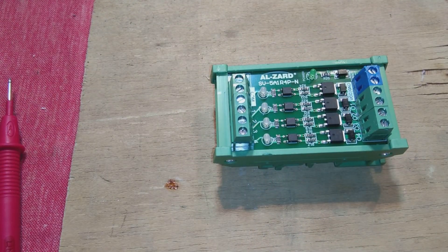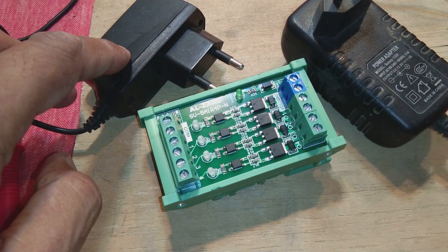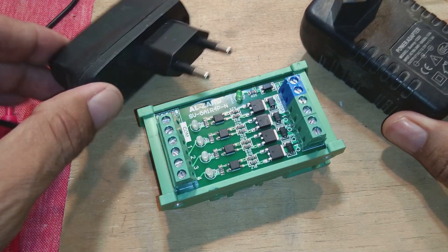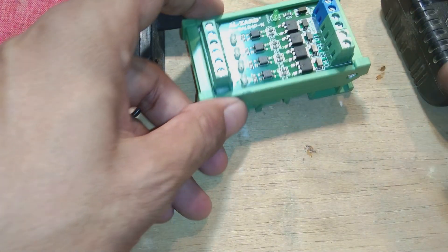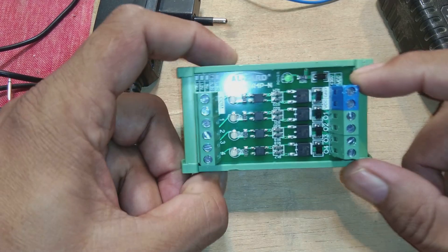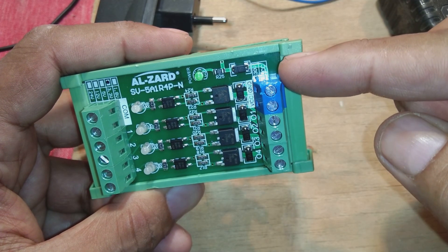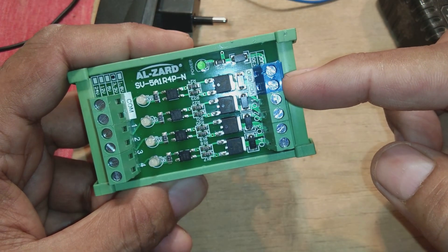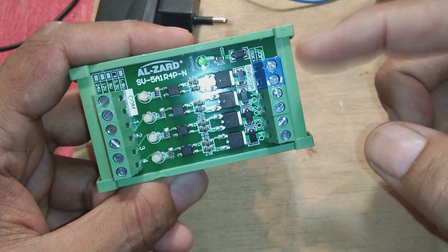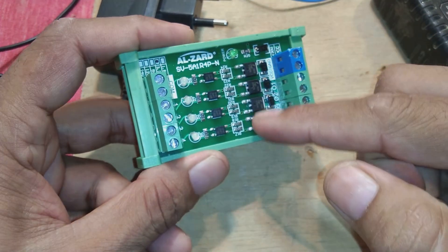For testing this unit we will need two power supplies. This smaller supply is for the input, and this bigger supply is 12V 1.5A for the output. The module can accept less than 30V DC — you supply it on the barrel jack, with positive VCC and ground connected to the provided terminals.